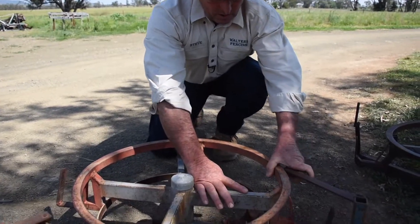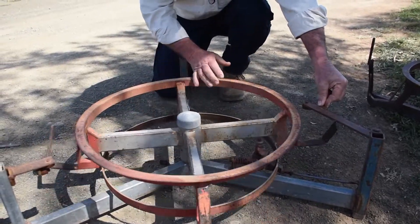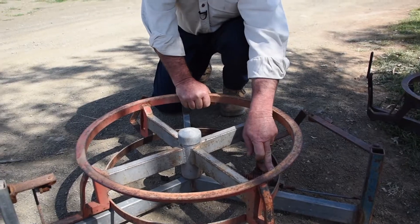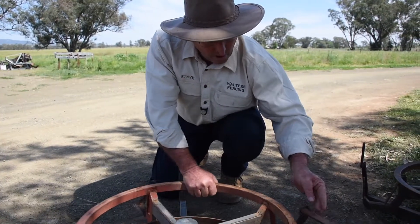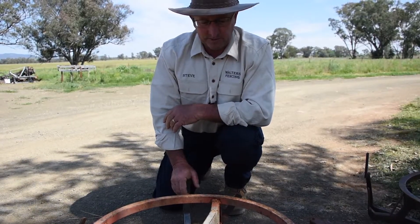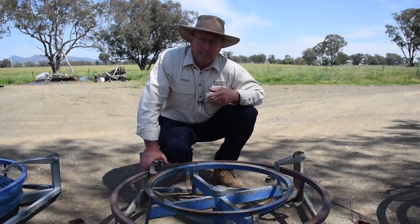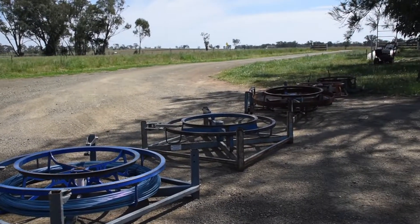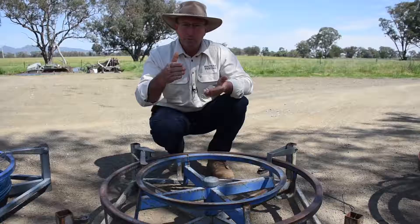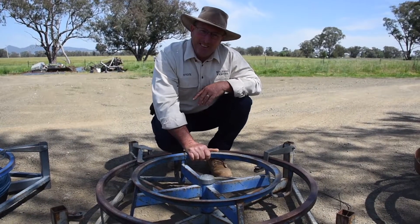You can see here a push-rod brake — as you pull, it releases the brake. In here is the critical bit: we actually had this internal brake design for quite a few years. As you pulled on the wire, it pulled the brake in, released the brake, and it spun freely — so all the design concepts are there pretty well. My editor asked me to explain the numbering system: a 1-point-something to a 2-point-something to a 3-point-something is a major change, and then 2.1, 2.2, 2.3 are small incremental changes within that overall design.